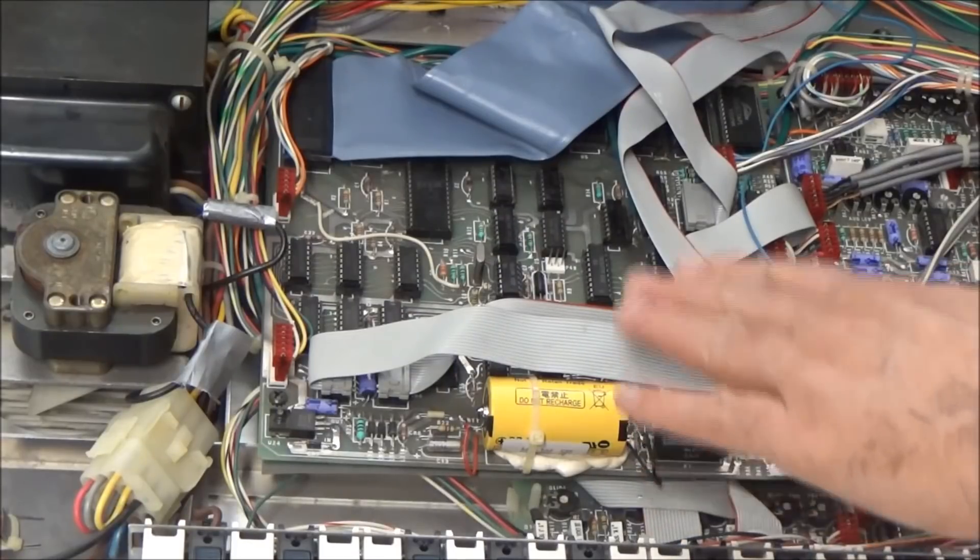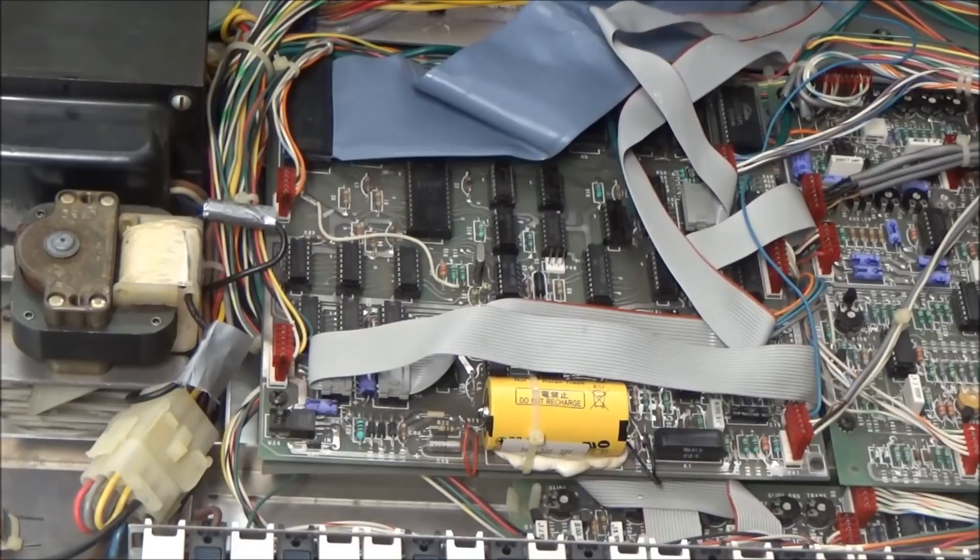Moving over to the left we have our CPU board, which they call the digital board. I think the Memory Moog and the Source were the only vintage Moog synths to use a CPU chip. Sometimes people are surprised that some of their favorite analog synths have a CPU inside. They ask, 'Well, if it has a CPU, isn't it a digital synthesizer?' And the answer has to do with how the audio signal you hear with your ears is generated. Even though this has a CPU, the sound you hear comes from pure analog oscillator chips that go through analog transistor filters. It's not a waveform loaded from a data table with some digital effects applied to it by the CPU. The CPU just runs the user interface and routes the signals, but the signals themselves are coming from pure analog sources.